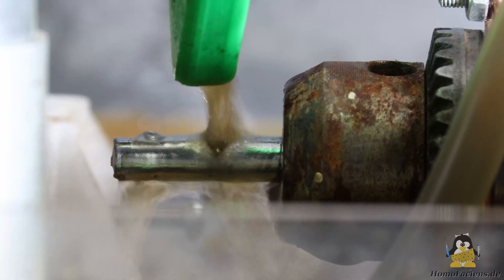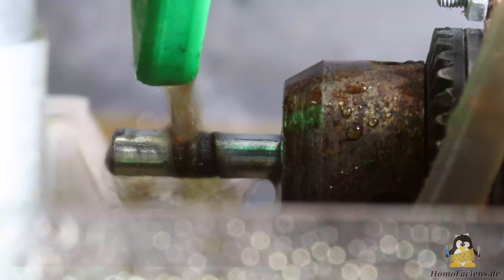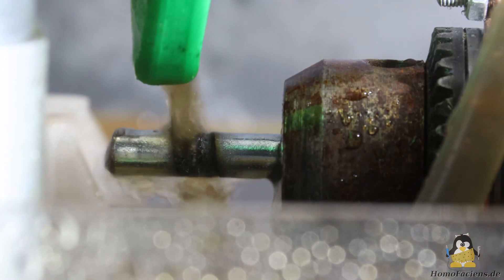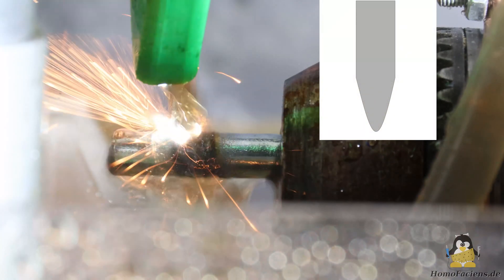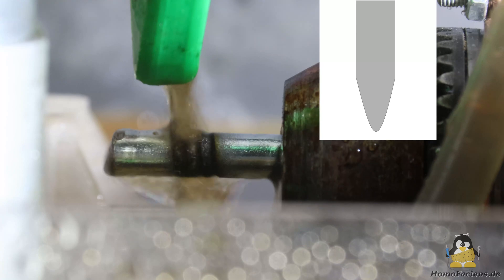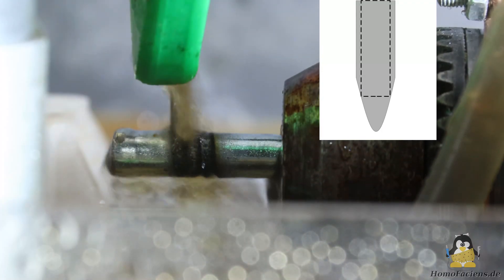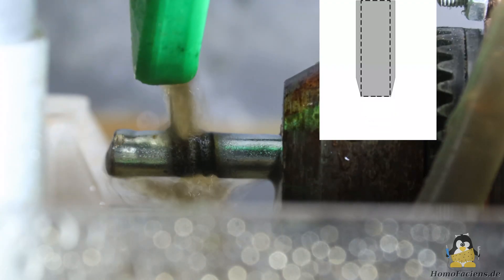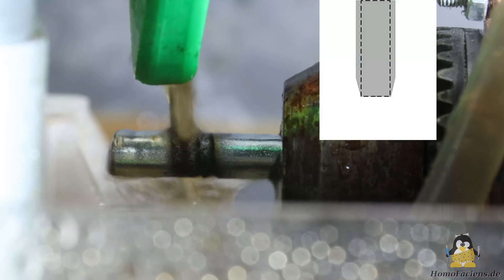For various reasons, tubular electrodes are usually used in spark erosion — mainly because this makes it possible to pump the flushing agent directly through the electrode, which is necessary when drilling deep holes. A look through the microscope showed that a solid electrode forms a needle-shaped tip during machining, resulting in a V-shaped groove being cut instead of a cylindrical one. Using a tubular electrode prevents the formation of a sharp tip, keeping the cutting tool closer to the theoretical shape of a cylinder.